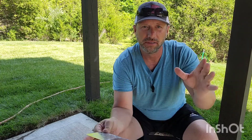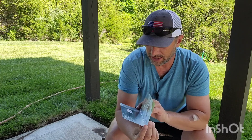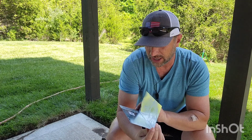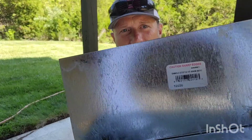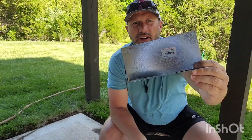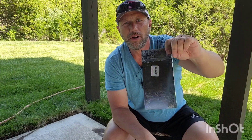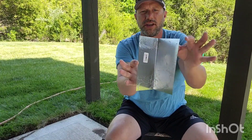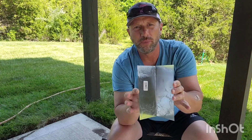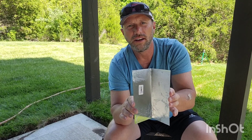These are from Home Depot — I love Home Depot. They're actually back in the roofing section and the tag on them is called a shingle step guard. Basically it's just a 90-degree angle piece. What I figured out is this is four inches and this is four inches, so you have eight inches total. If you have a four by four post you can just put this directly around the post.